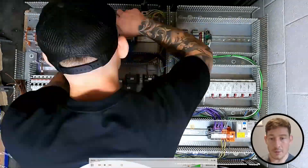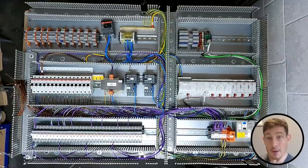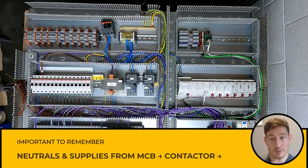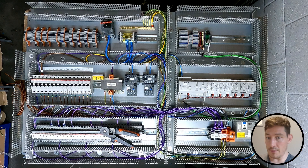So let's jump in. Onto wiring the contactors and overloads. Starting off with the neutrals and the supplies from the MCBs — these are going through the contactors. The overloads are connected to the contactors, and then they come out the end of the overload and go off to the terminal blocks to run pumps, fans, motors — pumps in this case.